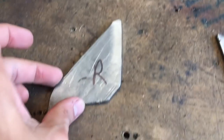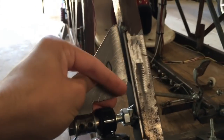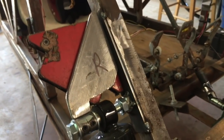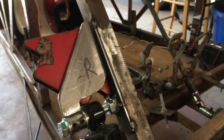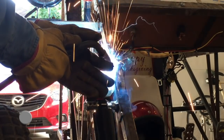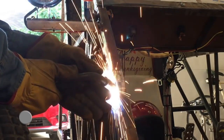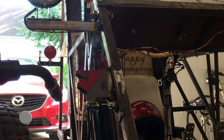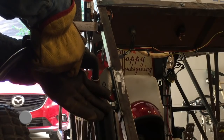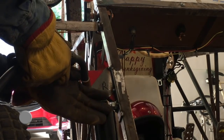Right, we've got our plates, they're all dressed and de-mill-scaled where we're going to weld them. I'll just show you how we're going to fit them up — like that. And then we'll have some weld along the two stop collars, and along there. We've got it held in there with an angle magnet thingamajigger. Let's get it tacked in.